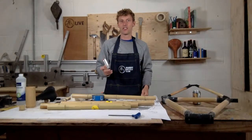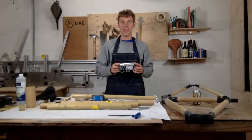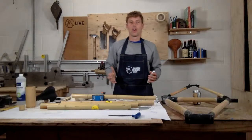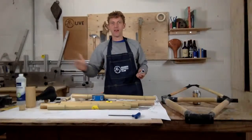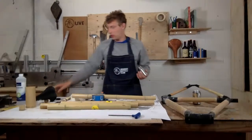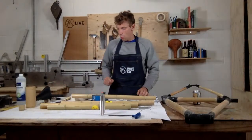If you missed our metal insert session, I talked through all the different types of metals we insert into the bamboo — that gives us the tolerances we need to make bamboo work as a conventional frame. In an ideal world you'd pick the perfect bamboo with the right tolerance, but bamboo is a natural product so sizes always vary. By using a standard sleeve we can fit to the tolerances of the bike industry — fitting a 27.2 seat post into our bamboo. That's what this sleeve does, and it comes in your kit.